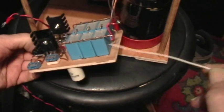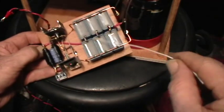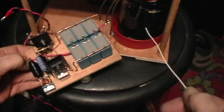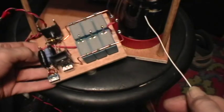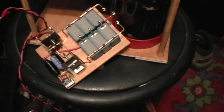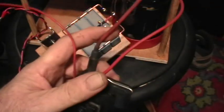I have six of these one microfarad, 275 volt polyfilm capacitors — high quality capacitors — hooked in a series-parallel arrangement that gives me a measured total of about 1.45 microfarads. That's chosen to match the 20 microhenry primary winding of the flyback transformer to make the flyback resonate at around 30 kilohertz, which gives the highest voltage output for these small flyback transformers.